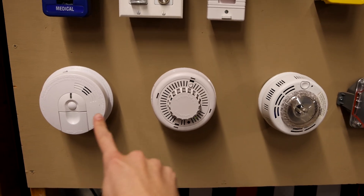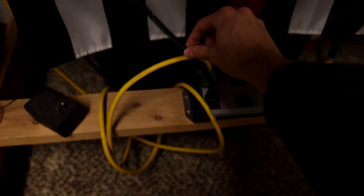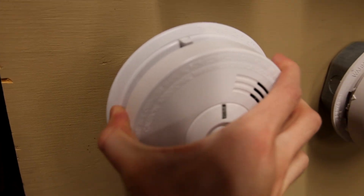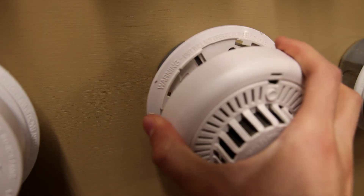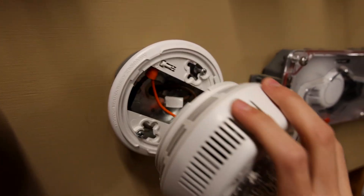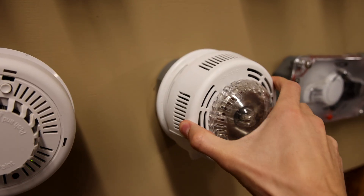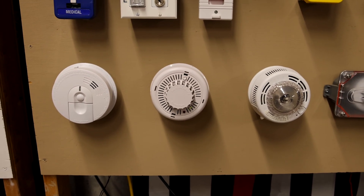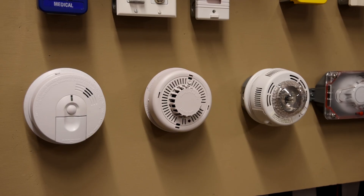Today is going to be about why you generally don't want to intermix brands when you're installing or replacing hardwired smoke alarms. These three smoke alarms down here are all hardwired, which means they have AC power — they're plugged in with this black plug right here — and they also have a third interconnected wire in the back. They're all wired in together, which means when one goes off they should all go off. They have AC power as their primary source and a battery backup. You might hear some chirping today because I don't have batteries in any of them.